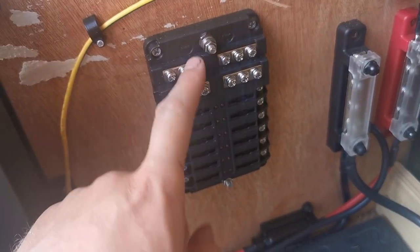And there we have it — charging! We are now getting power from the lithium batteries which are also connected to the whole solar system. As simple as that. I'll push the power button off and we've lost charge — perfect. So that's how you install an inverter in your camper van. Hopefully this video gave you some clarity. Drop any questions in the comments and I'll try to get to them, or the rest of the community might help. Right, I'm going to finish up some wiring — connect this fuse box and put the temperature sensor on for the solar charge controller.